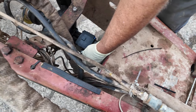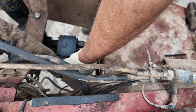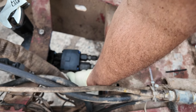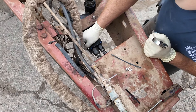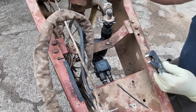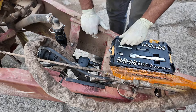So you release the jam nut — and I'm going to need a different tool, one that's going to fit that. In the book it states that before you start this pump up you're actually to back that bypass out two and a half turns. So you have to take it out two and a half turns. I need to go get a tool kit — I think that's like an eight millimeter.